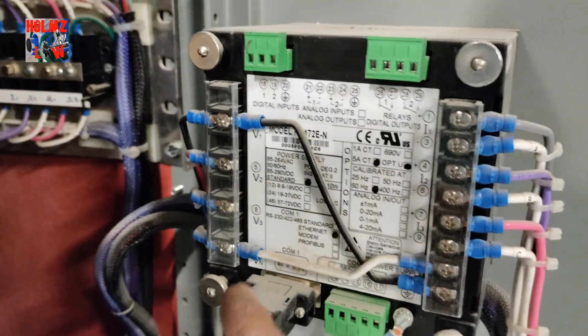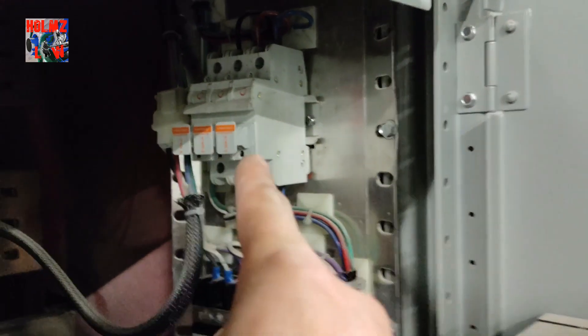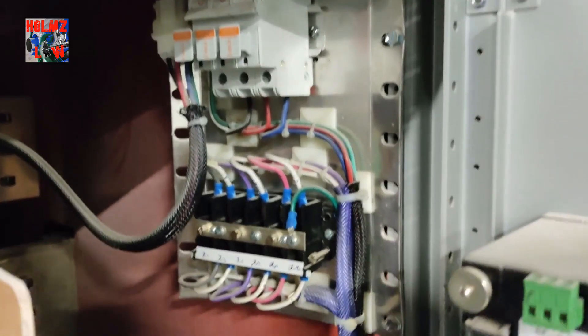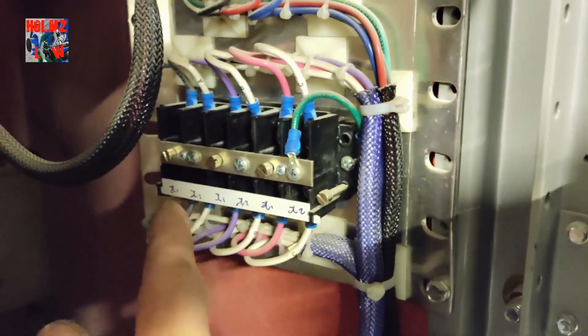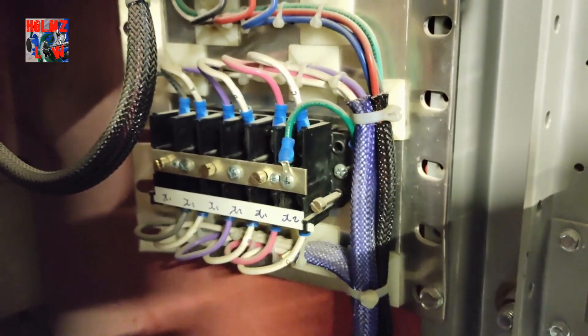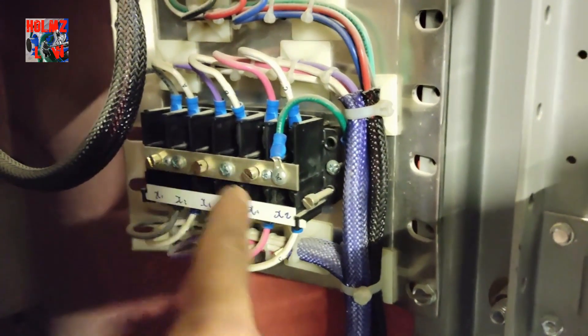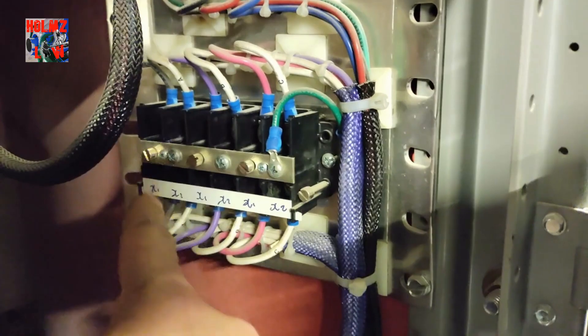This other side is reading the voltage coming from your buses as well. Before it gets to the meter, the voltage wires go through an actual breaker, which you'll have to turn on to get it functioning. The most important part is this shorting bar right here. To get the CTs up and running, you take off the screws on the positive-side phases.